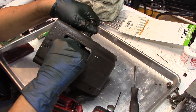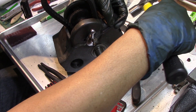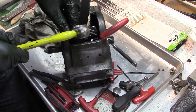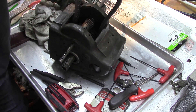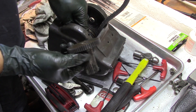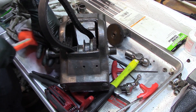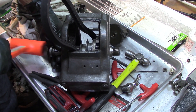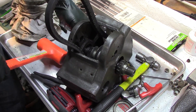As I'm coming back down I'm trying to work it out in my head. There are pins everywhere, so I have to knock a pin here and a pin there out of the headstock and slowly remove the stuff. Here I'm gently tapping this thing because there's a key on one side and I'm just trying to find out where that key is — tap, tap, tap — trying to line the key up with the slot to get it out.